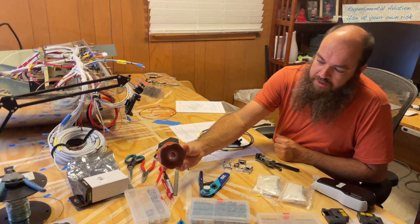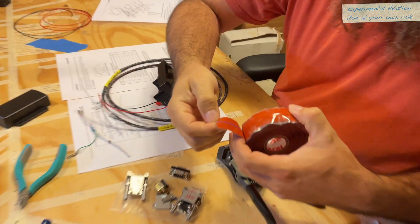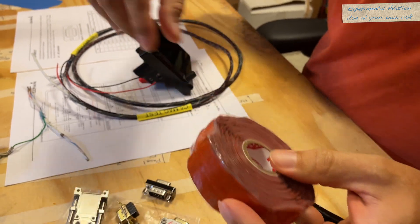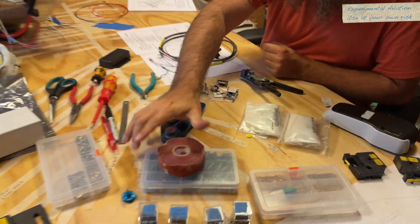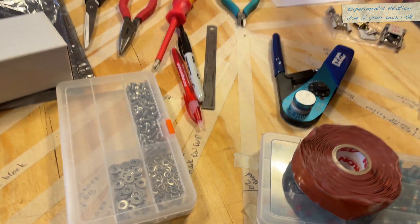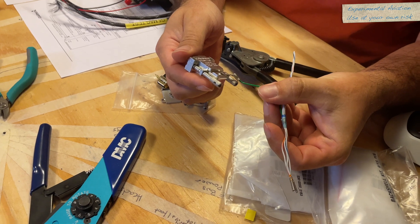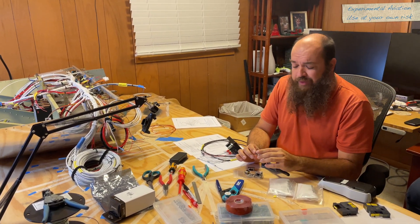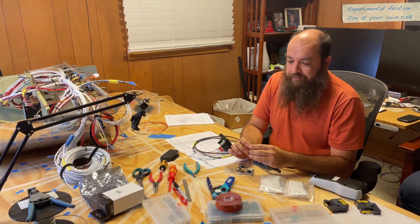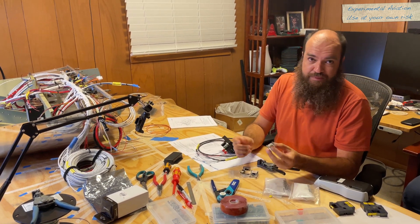You're also going to need silicone tape. You can find this anywhere — it's just silicone tape. You use it to create a little protected area for the wire; check the Garmin videos since they cover that in detail. We also have a little tackle box full of the proper length screws to screw the shield drains onto the back of the connector. These do not come with the connector kits, but you can buy them anywhere. I like to buy aviation screws and washers at the usual supply stores.